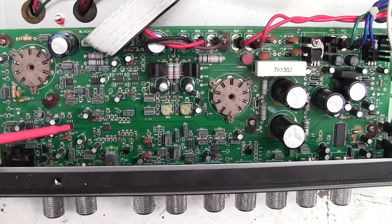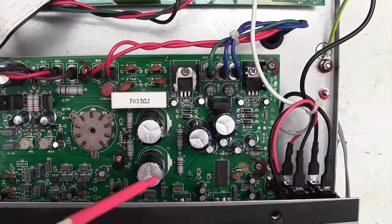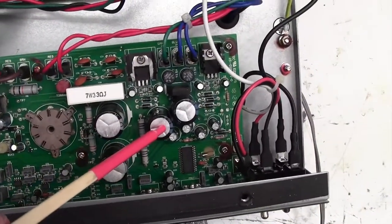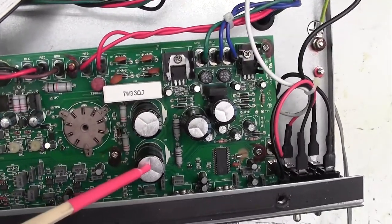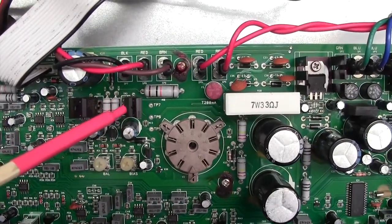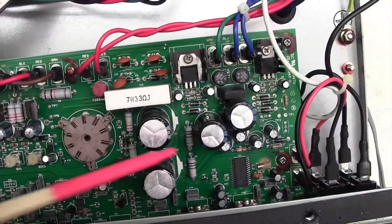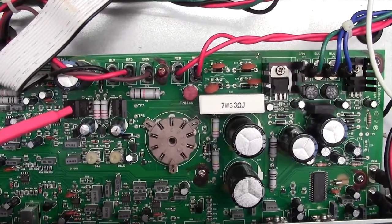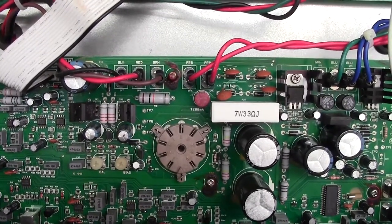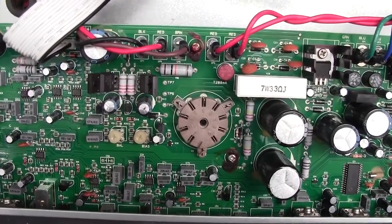However, I have had a little bit of success with these boards. The two problems I know about are these smoothing capacitors here — they go short circuit. And the number one cause of problems on Blackstars is these two FETs here — they go quite frequently. So I'm hoping we're going to get lucky with this amp and it'll be one of these two problems. I'm going to get the magnifying glass out now and have a close look at these FETs. If not, I might just change them on spec — it's not too hard to get the board out, maybe a 15-20 minute job.